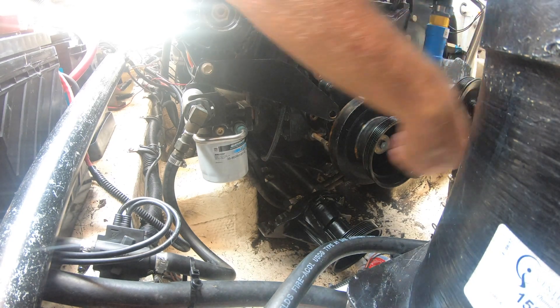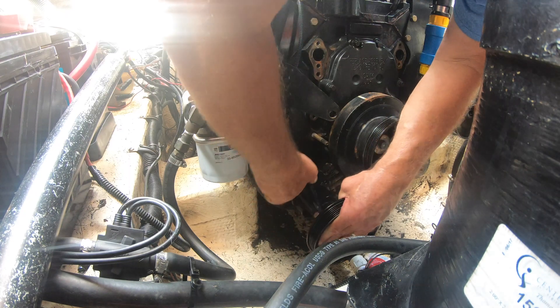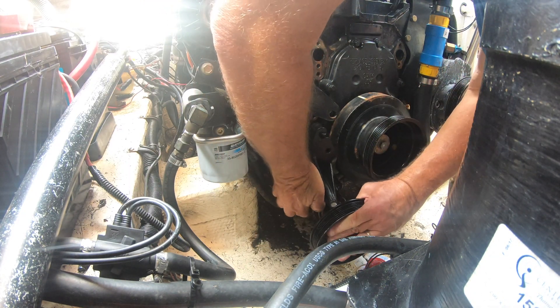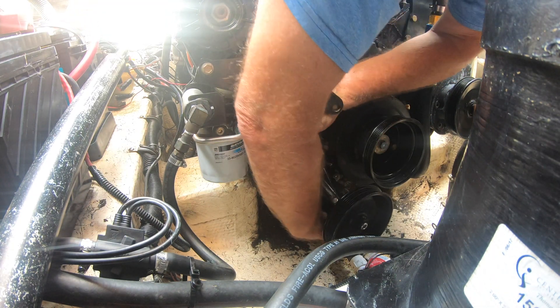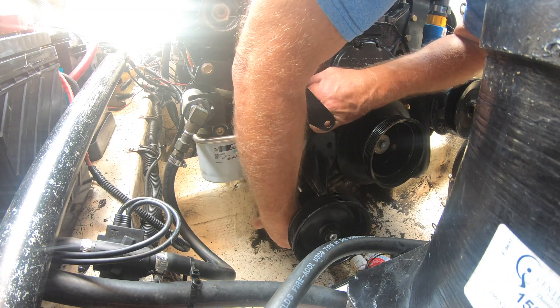While I was hanging upside down in the bilge, I figured it would be a good time to check the bilge pump and the float switch. You can see when I twist the water pump to put it in place, that's where it's kinking the hose — so I went back and fixed it.